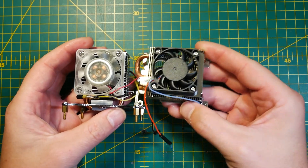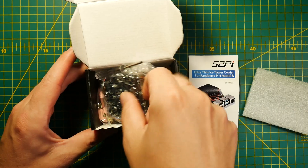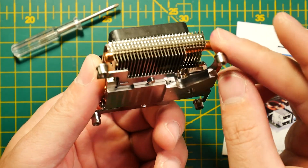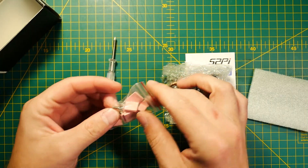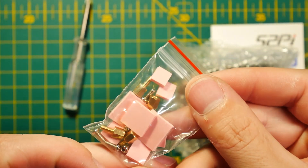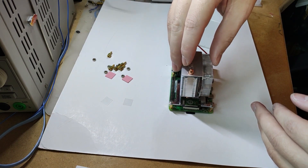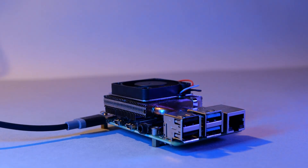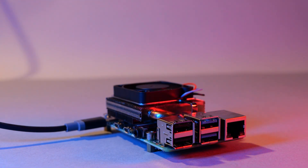Honestly, this is not how you do Ultra Thin, but it is Ultra Thin comparable, and in this video I'm going to check it out and figure out if it's any better — because it's definitely smaller. So what exactly does that 15-ish dollars get you? Inside the box you'll find the cooling solution — a heatsink and 50mm PWM-controlled fan you can use with external GPIO — plus thermal pads to apply to the Raspberry Pi. Unlike the original design which attached to the CPU only, this Ultra Thin version covers multiple ICs including the CPU, LPDDR RAM, the Ethernet IC, and the USB IC, so you're extracting heat from all of these components.